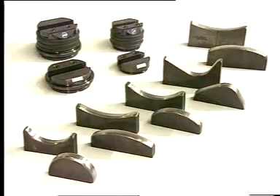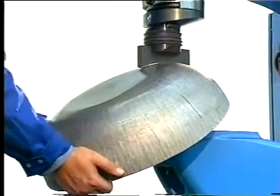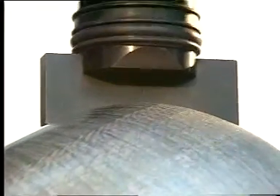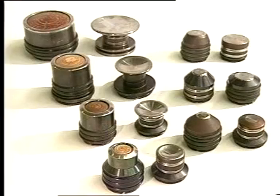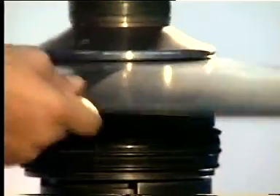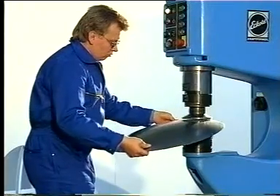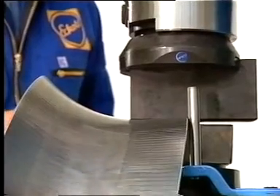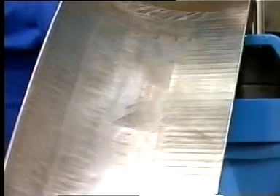The tool palette for precision forming. Using one of these special forming inserts in the universal tool carrier, the part is first shaped to the required form while at the same time planishing its surface. The stroke speed in this case was increased from 300 to 600 strokes a minute. The doming tool turns a similar even round shape in one forming operation into a tri-axially curved dome while simultaneously planishing its surface. With this tool, the edge of a manifold is partially stretched, with dimensional accuracy ensured by means of an adjustable tool stop.